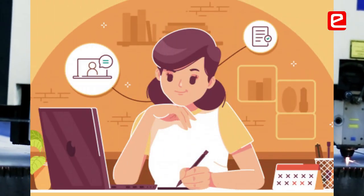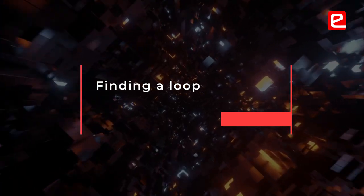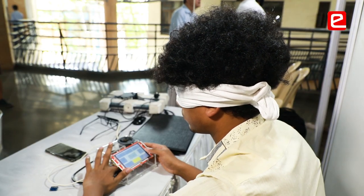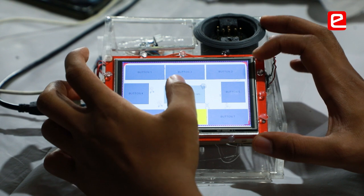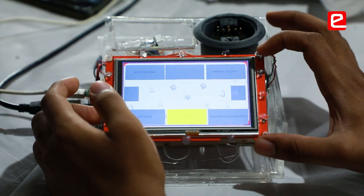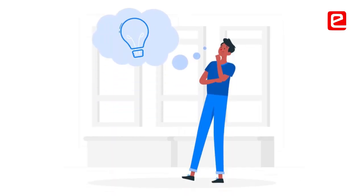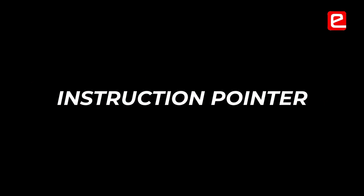We need to keep a two-day buffer to explain the project. If the sensor has started testing and is under progress, and somehow the user presses the restart or cancel button, what happened in version 1 was the loop was internally going off and the sensor keeps on testing internally. But the user on the display could select some other sensors and start other processes, so it was causing a loop and hanging up the system. We introduced some new variables and loops, and then applied break statements to come out of the loop.